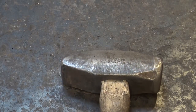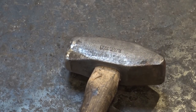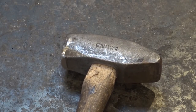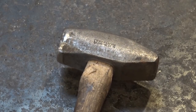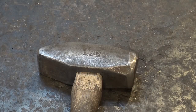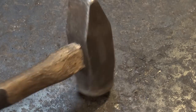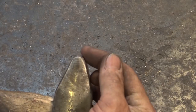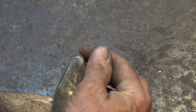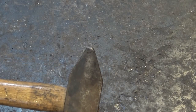This is my first ever forging hammer — I think it's only on its second handle. I've had it the entire time I've been blacksmithing. It's an old Sears Craftsman; I think they're still available, though I don't know if they're still the same quality. But this hammer has been a real workhorse. It's a two and a half pound generic cross peen hammer — nothing special, fairly affordable. You can probably find these on the used tool market quite cheap and just put a new handle on them. It has that fairly flat peen with nice radius edges, but not a sharp curved peen. A lot of the cheaper hammers have a much sharper radius and they just aren't really good for general blacksmithing.